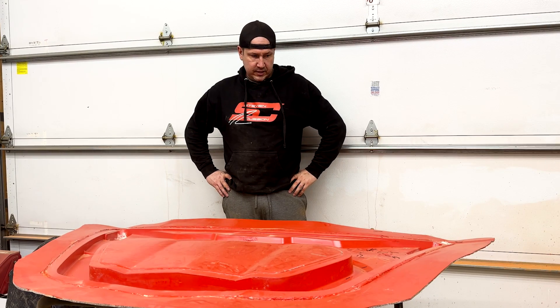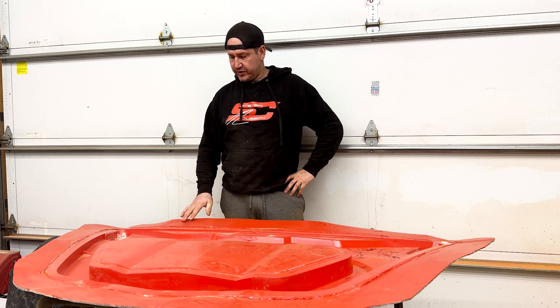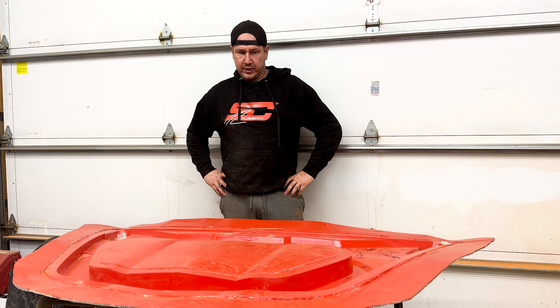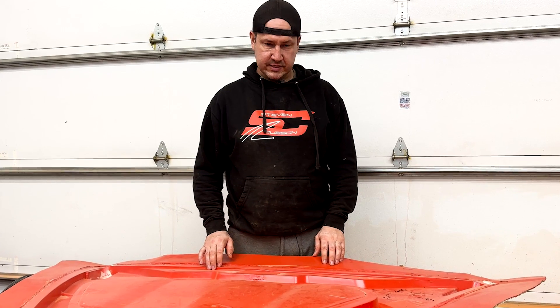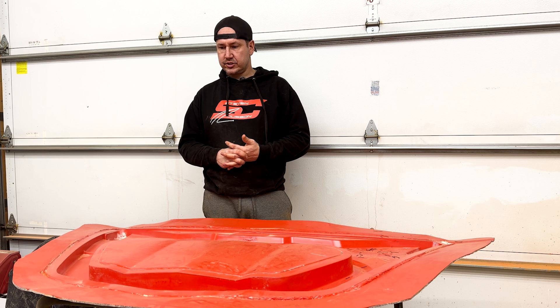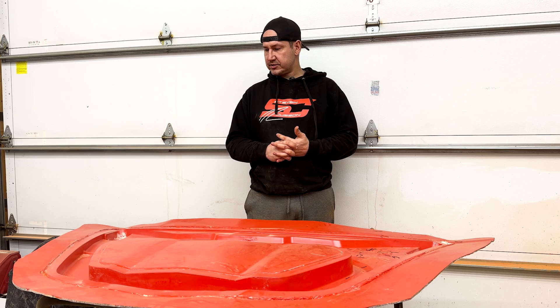It's time to get going on the structural or inner part of the mold. I've pretty much prepped the whole thing. We could vacuum bag this, but to lay it in one piece of carbon is going to be very difficult — carbon like fiberglass will wrap, but it pulls apart. So we're going to have to lay this in several pieces. For simplicity reasons, I think I'm going to do a wet layup: we're going to put down some resin and then put the carbon on top. I'm really hesitant because I don't have a lot of extra carbon — we have one shot at this.